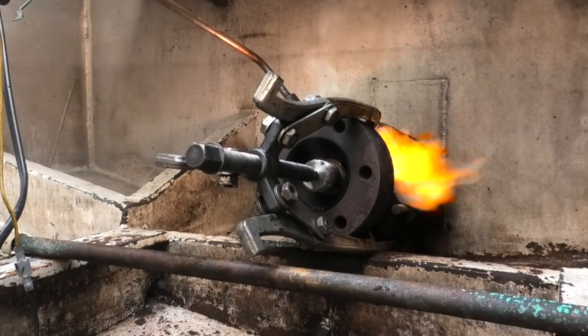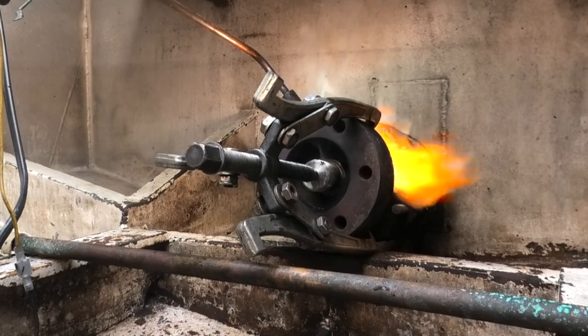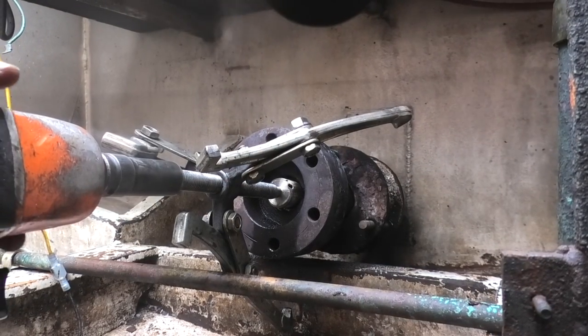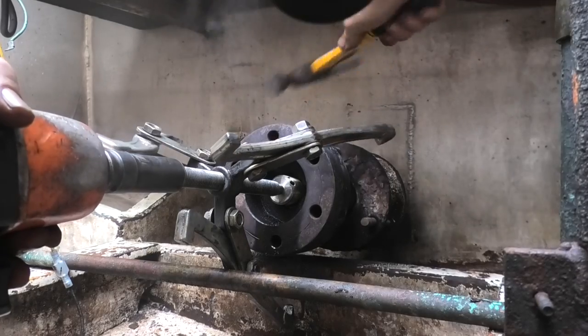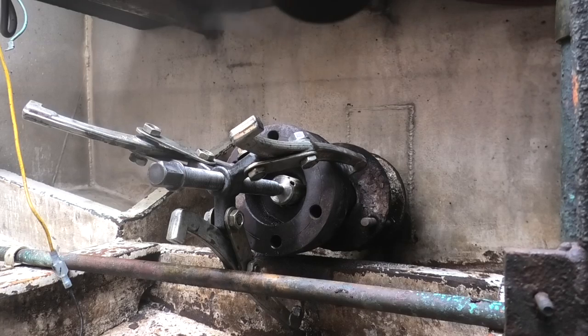While I was waiting for it to dry, I moved on to getting the flange off the end of the prop shaft so I can remove it. To do that I started by spraying it with penetrating oil, then put a puller on it and loaded that up with the impact gun so I had a bit of tension on it, then started to heat it. As it was cooling I gave it a couple of smacks with the hammer and it popped forward a fair bit, so I think we're home and hosed. I'll let it all cool down before I deal with it.